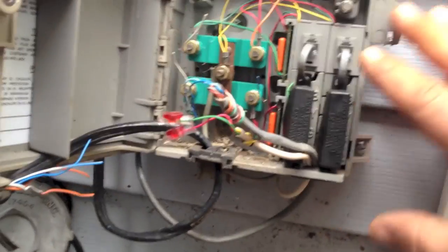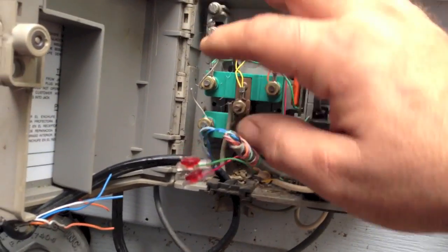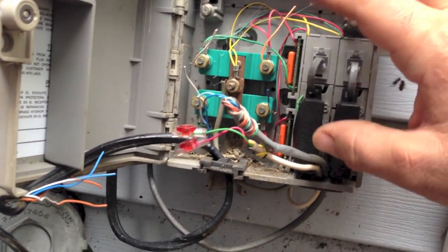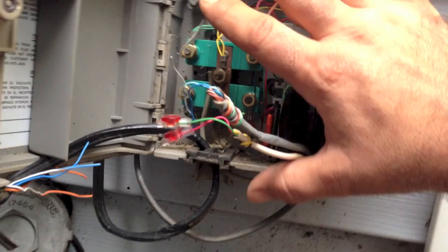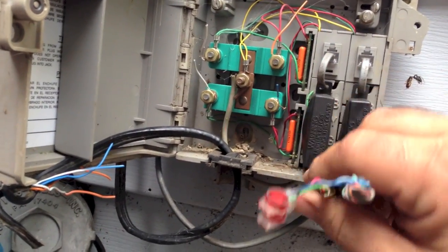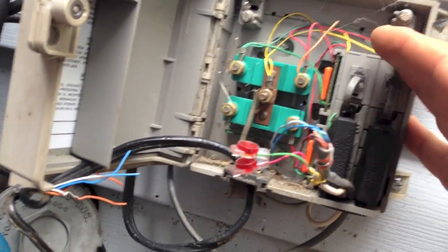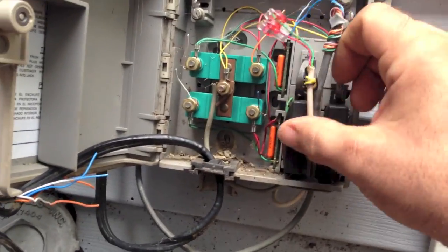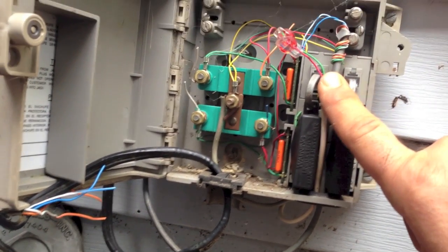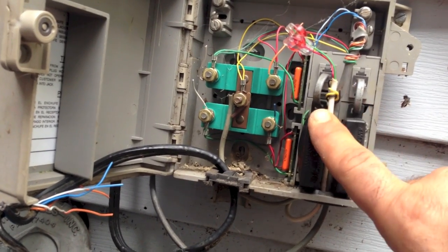You don't need any of this crap in here. This is all from the telephone service. They get their signal from the coax that comes into the house, into that box, and it's all programmed that way. This pretty much has nothing to do with anything except for tying the house wires together. So basically that is it. These other connections were from the original house, so you don't really need them. If you wanted to switch to Nettalk, all you have to do is make sure that all the house wires are together. And that's what they did because they're a voice over internet provider, Charter.